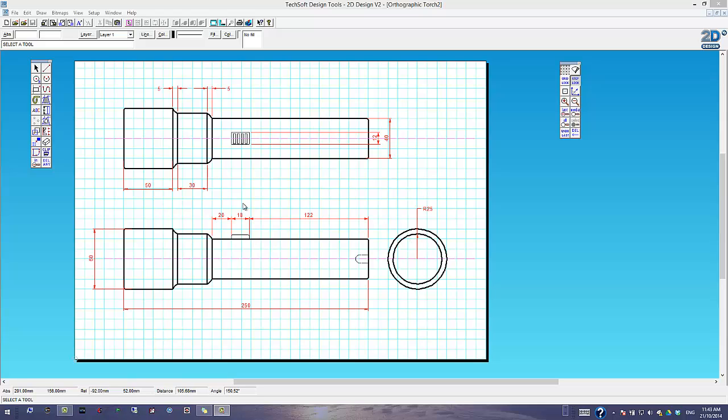They all line up. The edge of this one is directly in line with the edge of this one here. You'll notice there's a pink dotted line through the middle — that's known as a centre line, showing that the circles representing the end view are all in line as well. You have to make sure your work all lines up properly; you can't just put the views anywhere on the page — they have to be in line.